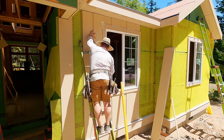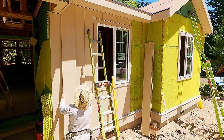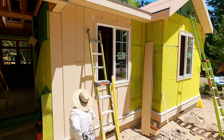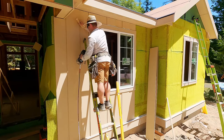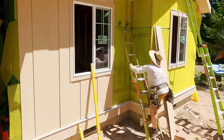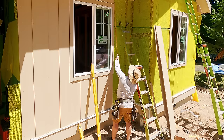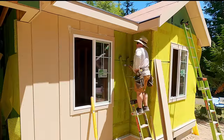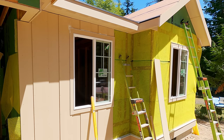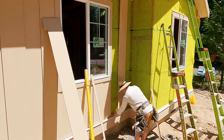Going parallel with all our trim, let's say my measurement from the window to the gap is three feet. Since LP requires us to be one quarter inch short to allow for expansion, I'll cut all pieces at 35 and three-quarters. You may notice I'm short of the soffit with all these panels — that's intentional. We trim that with a one-by-two nailed right over the bats, using a 16-penny nail to gap it off the soffit. That even gap looks way better than a caulk joint, it's zero maintenance, and it allows for full venting on the Benjamin Obdyke — not sealed at the top. Win-win-win.